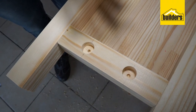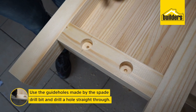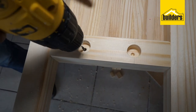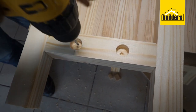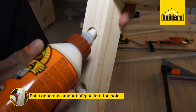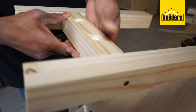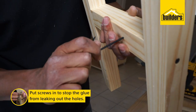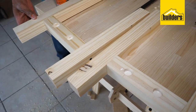A tip to make sure that you get a straight hole through this piece for your dowel sticks is to use the guide holes made by the paddle bit — you can see that hole will give us exactly the center of the dowel stick. Put a generous amount of wood glue into the holes where the dowels will go, and let it dry just a little bit so it becomes nice and tacky. In order to stop the glue from coming out the other end, just put some screws in there and that will stop it from leaking. Let that dry a little bit.